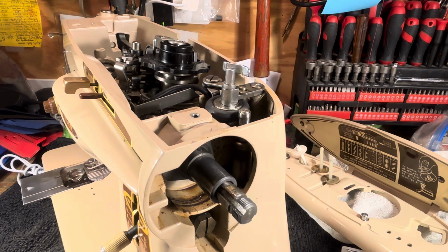You think I ain't got that kind of time? Well, that motor's worth $150, so maybe 5-10 minutes of your time is worth it to just follow those simple steps. If you want to take the hand wheel off, that's fine. Just let the motor run without any drag at all, but you can just loosen the hand wheel and that'll be fine. It doesn't really slow down the process.